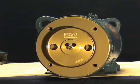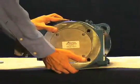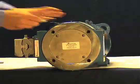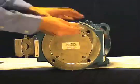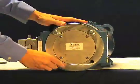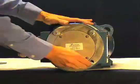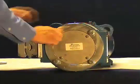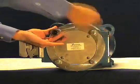Stator housing installation. Carefully move the stator housing into position, avoiding contact with the rotor. The sensors should pass cleanly over the rotor. With the AV850 large gap technology, the sensors can be installed in the housing before sensor housing installation. In this video, a sensor has already been installed in the housing using the hardware supplied. Do not force the housing into place. Install the four mounting bolts and torque to 30 to 35 foot-pounds. If the encoder will be exposed to water spray, the bottom quarter-inch pipe plug should be removed to provide a drainage path.